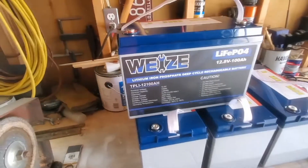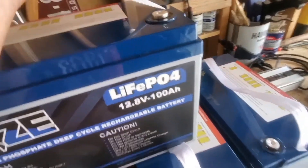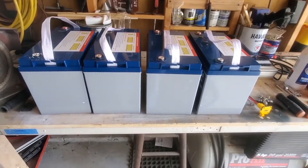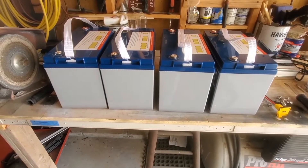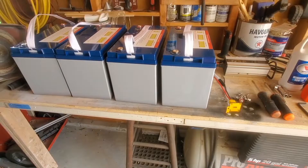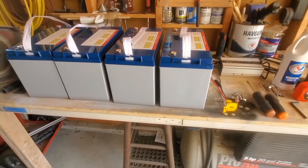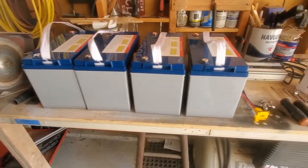These are the batteries I'm using. I've got four of them and all four have been pre-charged during this previous week. I charged each one of them with a 12-volt charger first, then connected them in parallel, let them sit for a couple days, and tried the 12-volt charger again and it didn't do anything. All my voltages are 14.1 at this point in time.